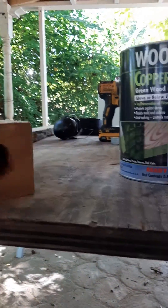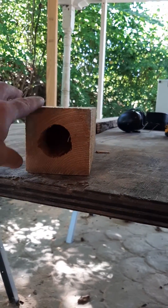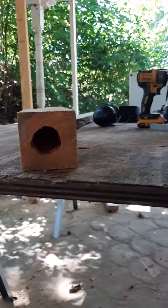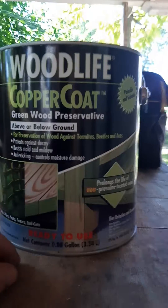I've taken a couple of these posts apart and here's the post bottom — this is where it sits over a little bracket thing that holds it in place. What I'm going to do is paint the inside of this with the copper naphthenate, then set it over in that five-gallon bucket and let them soak for an hour.